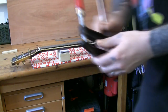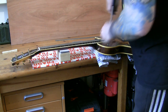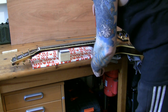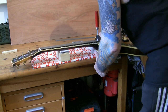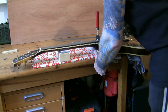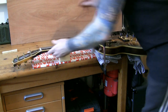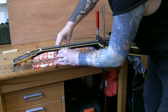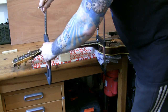We're going to take a regular F-clamp. This is not going to be tight - it's not holding anything with great pressure. All we're going to do is just hold this steel strip over, just hold that rod in place. And there we go - that's good there. That's it, all we're going to do is just hold it. Where we need to put the bend is here - that's already clamped on there. Now we'll just take a regular G-clamp, in this case a six-inch one.